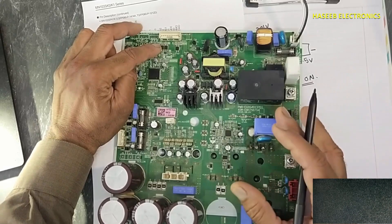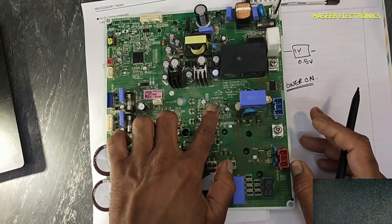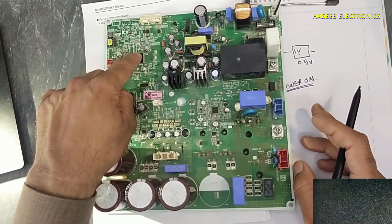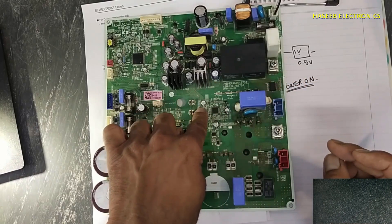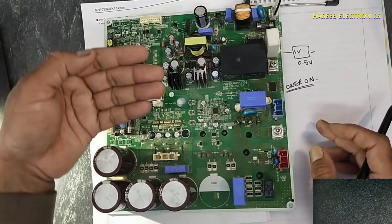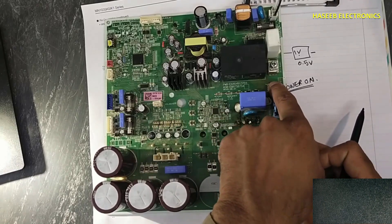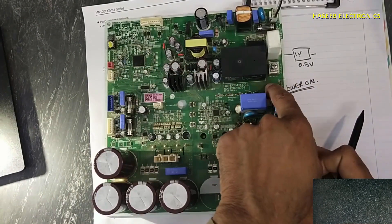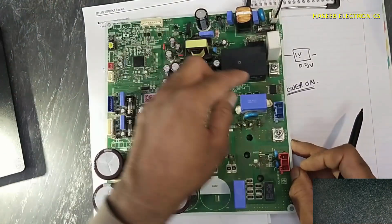It will analyze and verify their function. In any abnormal condition, it will turn off the system to protect it from further damage, and send the present status to the indoor unit board. For example, if an IC malfunctions, that IC will send feedback to the microcontroller that something is wrong. The microcontroller will check its process sheet and transmit the appropriate code to the indoor unit, which will display the message — for example, 'PFC section fault' or 'overcurrent condition.'